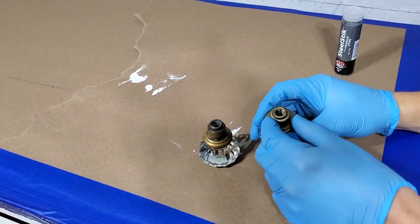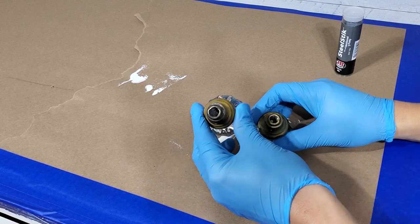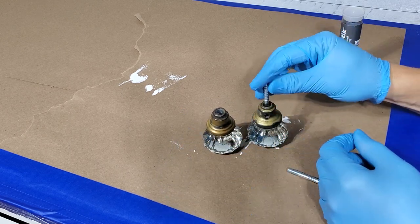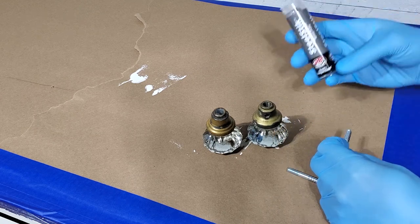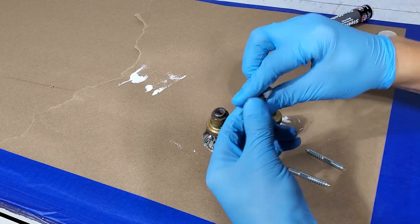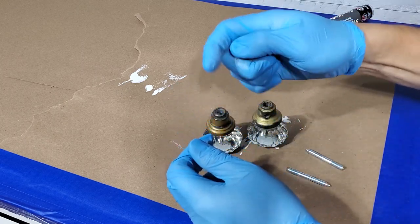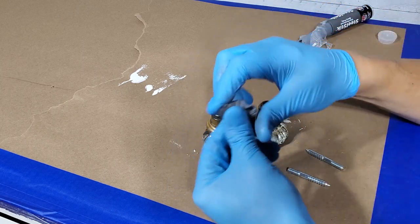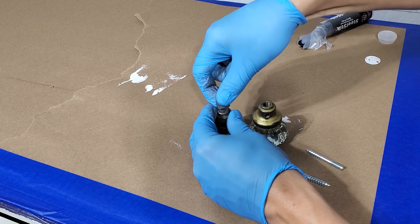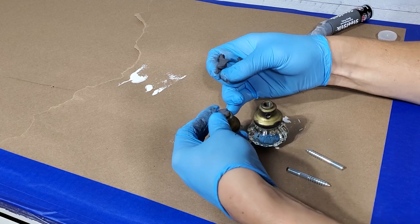So on the top drawer, since we were missing a couple knobs to begin with, we're gonna use these old glass doorknobs. Now, I've used this method multiple times and it seems to work pretty well. I use these hanger bolts and also some of this JB Weld steel stick. You take a piece off, knead it together, the two parts mix. You fill in the doorknob piece with that steel stick and then work your bolt in so that the threaded part is sticking out. That allows you to screw that into a piece of wood and it'll look like any other knob.